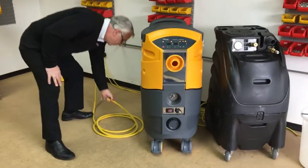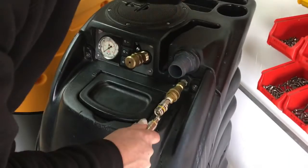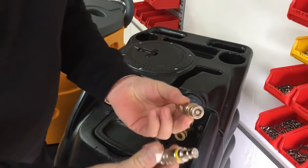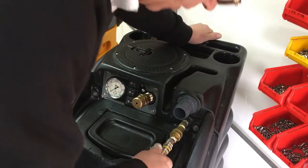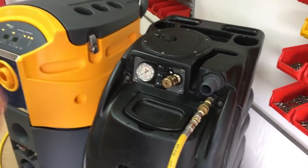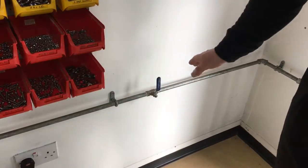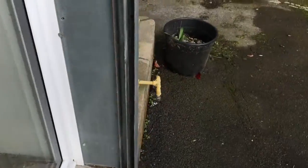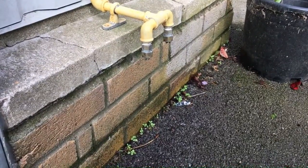The first thing I'm going to do is couple up the first machine — the higher pressure machine. This is just an adapter we've made up; our fittings are different so we've made adapters to put the test rig onto this machine. We've got five metres of hose running to the test rig. There's a valve that shuts the test rig off — at the moment there's no flow through it whatsoever. Outside you can see an assembly with two 110-degree fan spray tips with 03 jets, which will mimic a carpet wand.